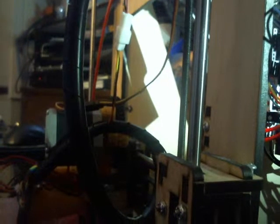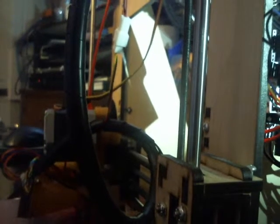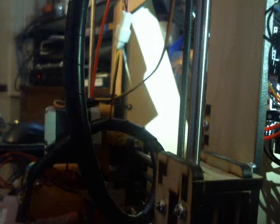What I did was I turned it all the way. I kept turning it until the motor stopped moving. I wasn't printing when I did this, obviously. What I did was turn it a little tiny bit. They say turn 1/8 of an inch. That's too much. I turned it even less than that, and I would run whatever axis I turned it.